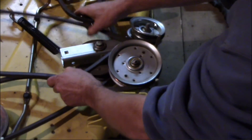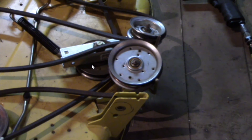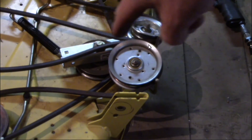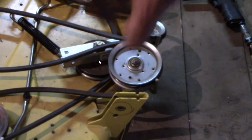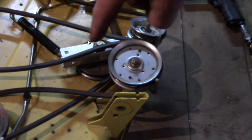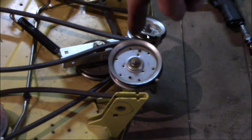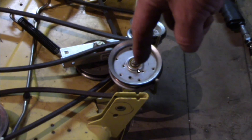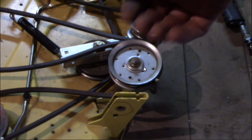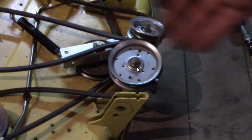I hope that helped somebody out because I've gotten so many comments on just breaking belts clean and not being able to figure out why. Go through all your pulleys and look out for wowed-out holes underneath. This bar was originally contributing to breaking belts because that hole was hideous — it had so much play, this thing was literally going up and down. But it still broke a belt, so I took this one off and found that one's oblong too. Adding that washer underneath the shoulder bolt did the trick because the height of the pulley was sinking. Thanks for watching.